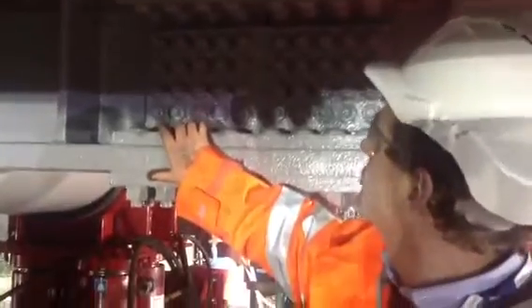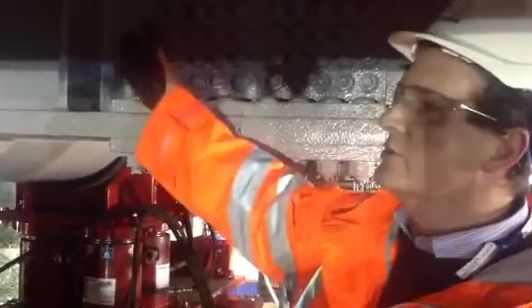There you've got the main tubular steel truss which will support the whole bridge across the station. Here you've got the main cross girders which tie the two sides of the truss together, and then on top there you will have a concrete slab which will actually support the truss across the whole of the bridge.